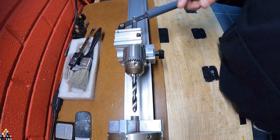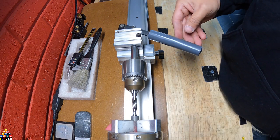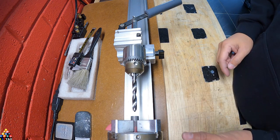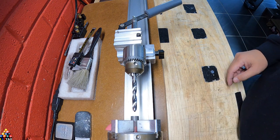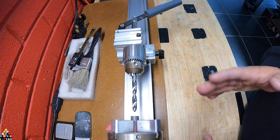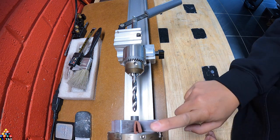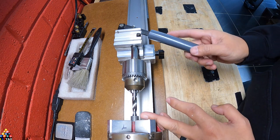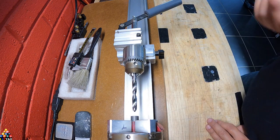When I was drilling inside the carbon shaft and getting the T34 out, I noticed this T34 goes pretty deep, so I'm wondering how deep he actually put the T34 tenon inside the carbon. That adds a lot of weight on the carbon because you're adding so much mass, making it a deflection shaft. I don't know if he liked it like that, but I drilled a little bit over an inch. I'm going to clean this all out and then put the G10 rod in.